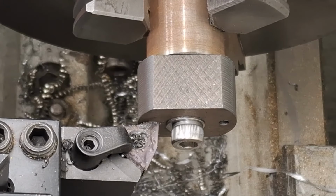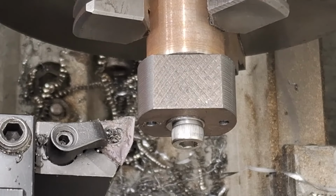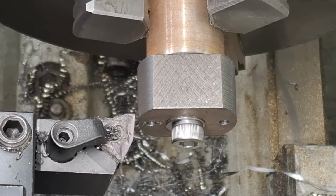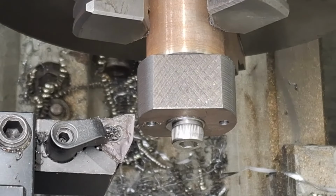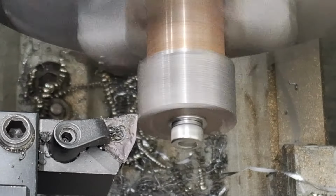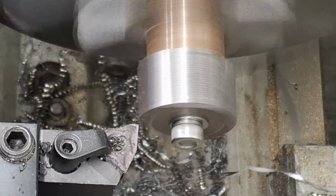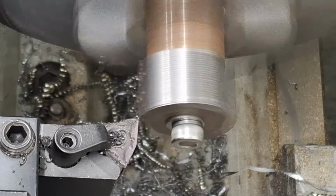Now, of course, on this machine, that's my 0. Back there now. 12 millimeters is 4 full turns of the top slide dial and 92 divisions. Right, so let me just get another touch off here and then we can start going down 4 and 92. There it goes. There's my touch off. Put on a feed. Cut, rather. And here we go.